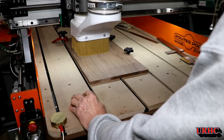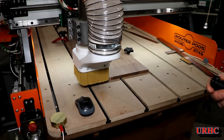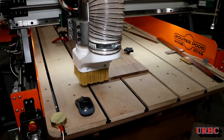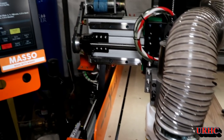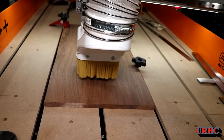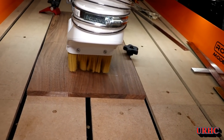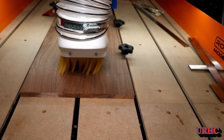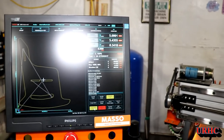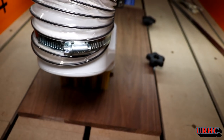Then over to the CNC router, and these are actually the first pieces ever run on it, so I'm kind of nervous something might go wrong. I'm still having trouble with the motors — I haven't finished the update on the router video yet because I bought a motor on Amazon, one of these Chinese closed-loop steppers, and it just didn't meet the specs it was sold with, so I've got to replace that. You can see the spindle comes on. I'm running it at about 60 inches per minute right now, which hopefully will be four times that when I'm done. I'm just using a standard MLCS router bit, which is part of the problem. I do love the Masso — very easy to set up and use for running jobs, probing, and finding bit heights.